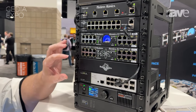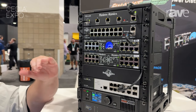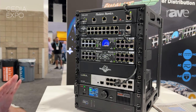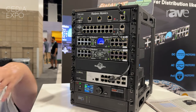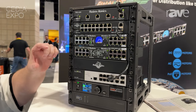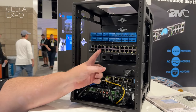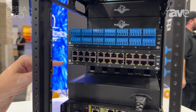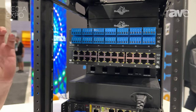Inside both of these units are very state-of-the-art ESM modules. Typically you don't see this in consumer electronics — it's usually something military or spacecraft using this. We've taken that same technology, and we have a couple of patents of our own on this. This will allow you to power up to 48 shades in one RU with no AC power. There are 24 PoE BT ports on the back — every one of these ports can do 90 watts. This is a real PoE BT switch, but it's specialized for shades, and most switches can't usually do all 24 ports at 90 watts.